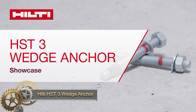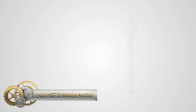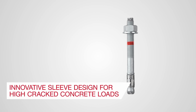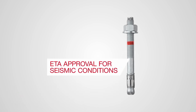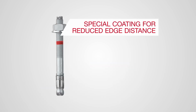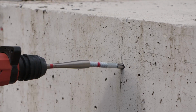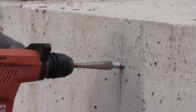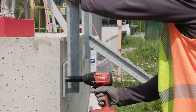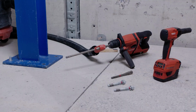The Hilti HST3 wedge anchor stands out as a high-performance and versatile solution for safety-critical applications in both cracked and uncracked concrete. Crafted from zinc-plated carbon steel, this wedge anchor excels in load-bearing capacity, catering to projects with intricate geometrical requirements. Its optimized wedge design with an increased undercut percentage ensures superior holding power and heightened safety levels. Offering flexibility with 2 embedment depths, the HST3 accommodates diverse applications and material thicknesses.